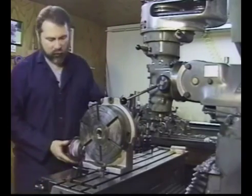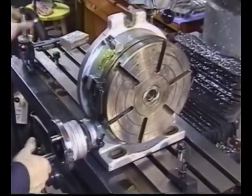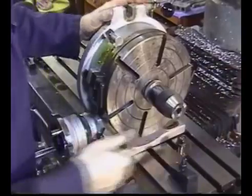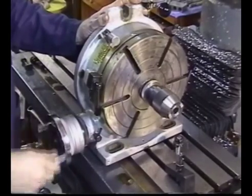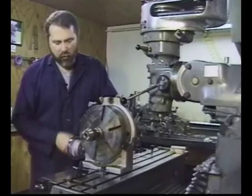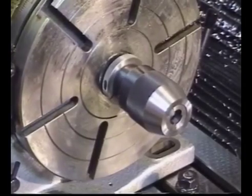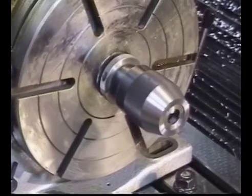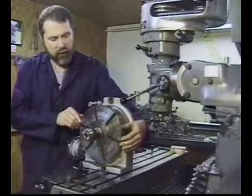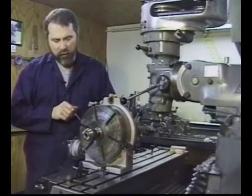Okay, there we are in a vertical position. We can continue the rotation of our part. Imagine we have a drill chuck in place or a lathe chuck. We want to continue to advance those parts, drilling, tapping a hole pattern, machining a groove, a cam, whatever the case may be. So it's a very versatile application. Again, we would lock down our gibs anytime that we were to make a drilling or milling operation, holding our workpiece very rigid.